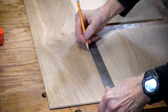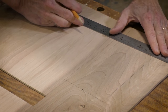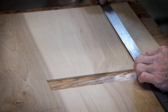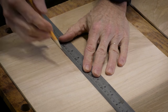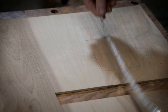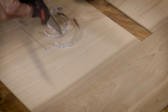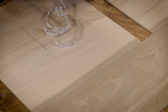Now I'll mark out the locations of the LED lights. I'm drawing two rectangles - one is in the location where the fireplace screen is on the front, and the other one is where the pegboard is. The LED strips have an adhesive strip on the back and they have copper leaves every third light, so you can cut them in increments of three lights.